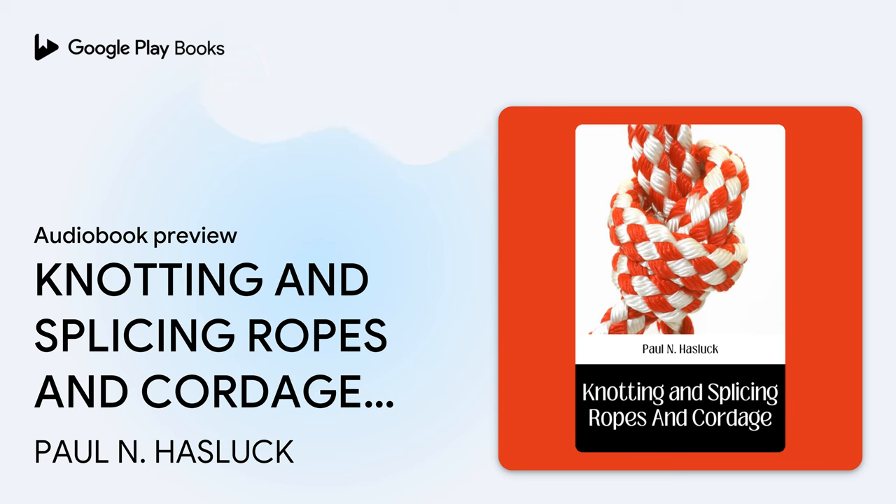The principle of rope making is very readily shown by holding the ends of a piece of twine or whipcord, about a foot long, in the hands and twisting it so as to increase the lay. If the twine be now slackened by bringing the hands nearer to one another, a loop will first form in the middle of the twine, and it will continue to twist itself up into a compact cord which will not unlay, as the tension to which the strands have been subjected causes friction between them, which holds them together. In other words, the tendency of each part singly to unlay, acting in opposite directions, is the means of keeping them together when joined.